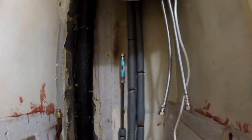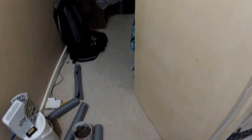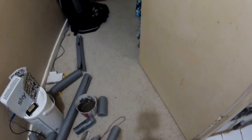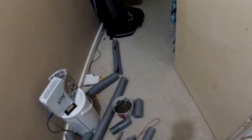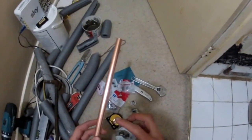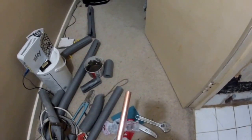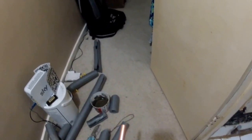After fitting the boiler, you can see we need to do the pipework — connect hot and cold water. I've got a pipe here, so I'm going to cut it and use some elbows and compression fittings. Cut the pipe to the length you need. You don't need a plumber — you can do it yourself.